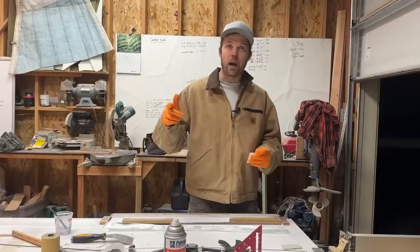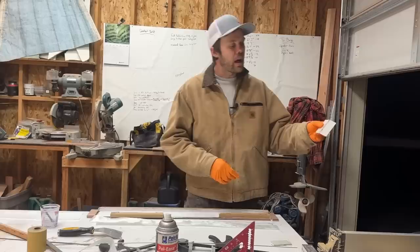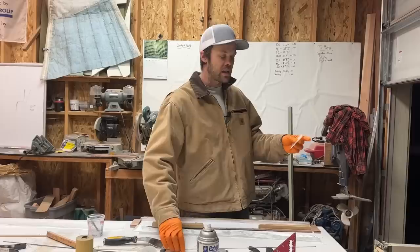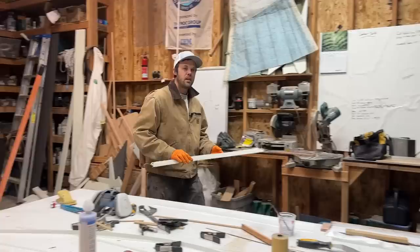One thing I really like to do is tinker and experiment and make little things. And so the other day I tried making hinges and I was relatively successful. All it is, is a brass tube, 3/32 inch outside diameter. And then there's a stainless steel pin that goes through it. It's 1/16 of an inch. I took some fiberglass tapes, went over the brass tube like that. So what it came out with was this long piece like this.